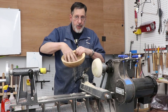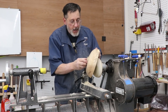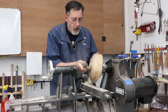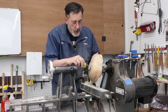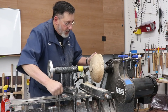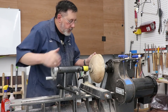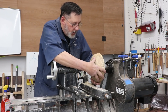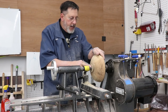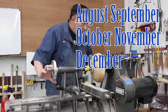I'll save this friction drive and use it when I'm finished with this particular bowl. I'll finish the inside first and then put some shelf liner or paper towel on there for protection. In my tail center — my live center — it's the same live center I use when I rough turn this bowl. I can see the indentation in the bowl, so we'll crank up the quill and find that little indentation. The date on this is August 1st, 2020, so that was quite a while ago.